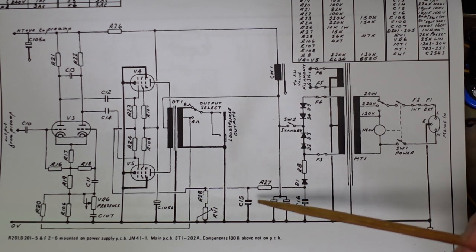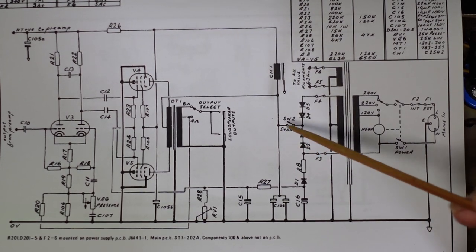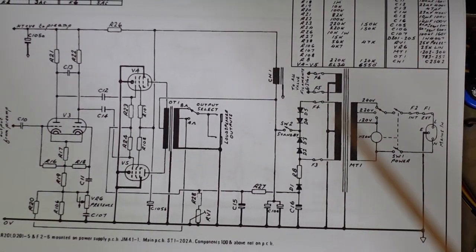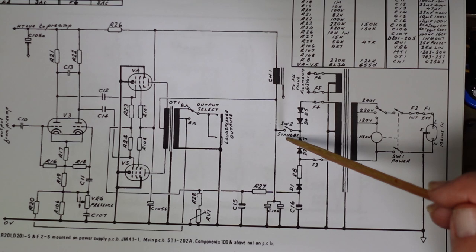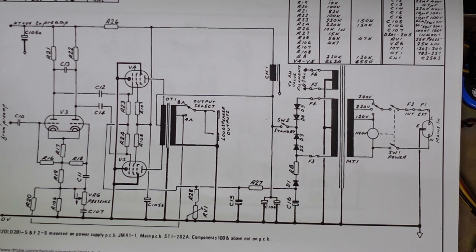So even if we did have large capacitors here for C15, C16, and this is probably applying to most amplifiers, always good to check which side of your standby switch your main filter caps are. Sometimes they're on the other side. So if you delay even by a second from power on to standby into play mode, by that stage, these capacitors have charged up anyway. I guess the precaution is, what if someone just flicks on both at the same time? Then that's why I have my reservations about making these too large.